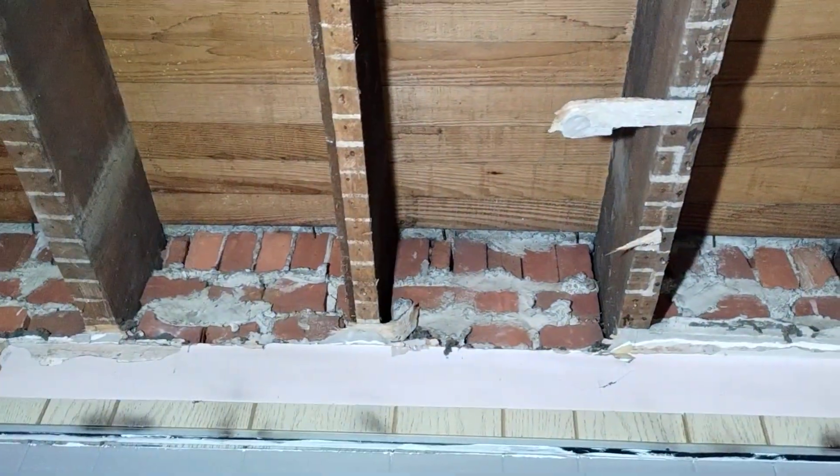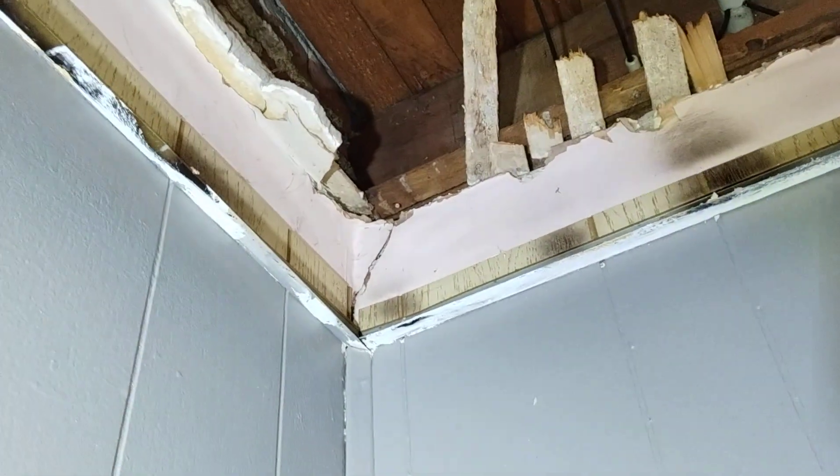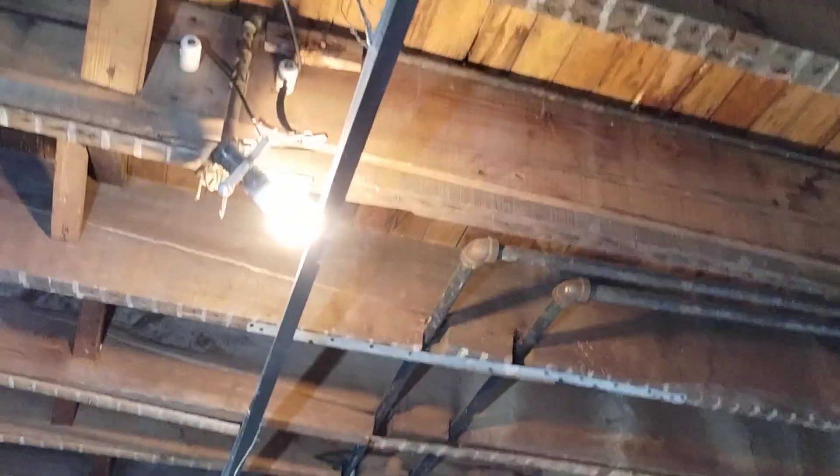We're back at the structure here. You can see the pockets are all pocketed well over there, including brick going up between a party wall, which is really good. Nothing over here – that little fracture turned out to be nothing. All the joists are pretty good except for these – one, two, and three.